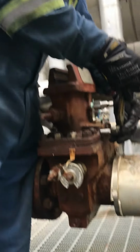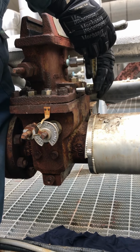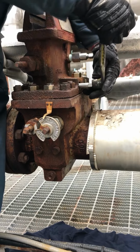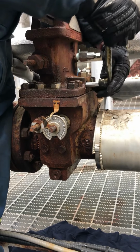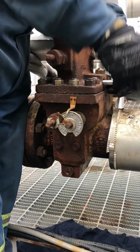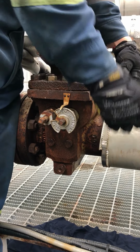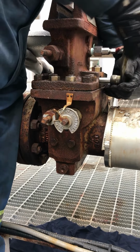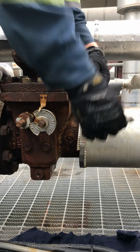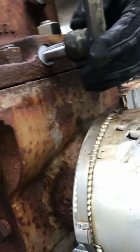So then when you go to turn this open, this stem has got a separate thread in here. You'll turn this guy here, whether it's hard or not, you're unscrewing it. And when you're unscrewing it, it'll get back to a point where it starts to push on the Teflon to bring it out. And usually that's when it gets really hard and tight. The new one here will come out easy, but you'll see how the Teflon is starting to push out. You can see it pop out.